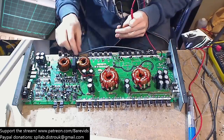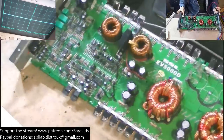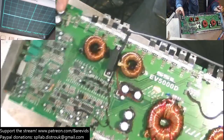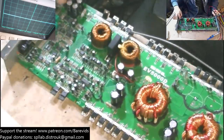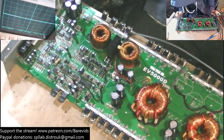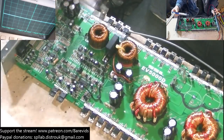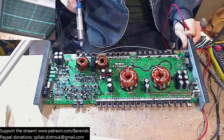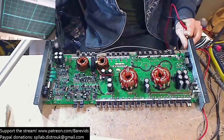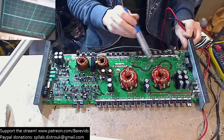So this one came in, and the first thing I noticed was we have vented caps on the output side here. So up here, these caps have all vented. Now these caps are across the speaker outputs, and they will probably be to smooth the rails, and they're after the inductors. So they probably vented because the amplifier most certainly lost one side of outputs, which caused the other side to drive full DC, which then blew the caps, which weren't expecting that,